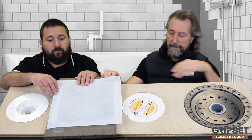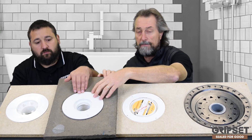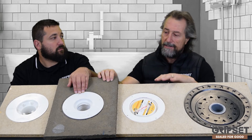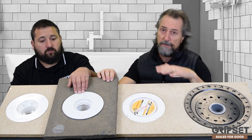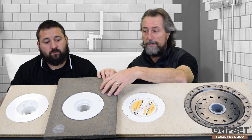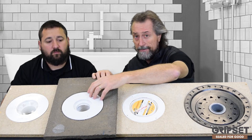Whether you're using the Express Lay system over the whole floor and then screeding on top, the PF system, the HD system, or any of our liquids — the same principles apply for every Gripset application, whether it's our 2P membrane, Gripset 38 FC, or Multi Pro. On top of the screed, you go in with the butyl square again, remove the release paper, seal that joint, and then it's that continuous membrane into the puddle flange — fully integrated. Around the perimeter you've got your Elastoproof or BRW tape to seal the wall-floor junctions, and on top of the screed you reinforce with the 11Y. It's completely sealed over and under, and you attack the puddle flange the same way both under and over — identical. There's no compromise. That joint is bridged, reinforced, and sealed immediately — no waiting for drying, no delays.